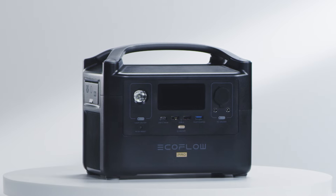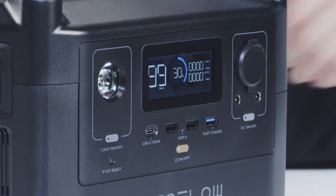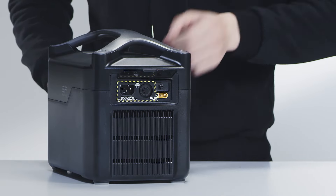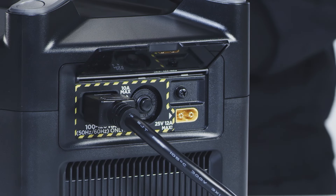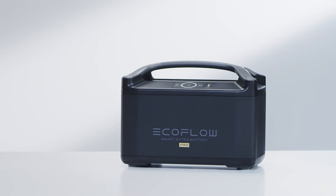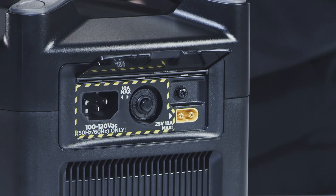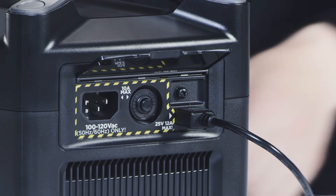The River Pro battery will be charged at around 30% straight out of the box. Fully charge the battery before you use the product for the first time. EcoFlow X-Stream technology enables you to fast charge your power station using a regular wall outlet or pure sine wave gas generator. River Pro could be charged from 0 to 80% in one hour, achieving a full charge in 1.6 hours. To charge the River Pro Extra Battery, please connect it with River Pro. River Pro can also be charged from the XT-60 port using solar panels or from a car using the car lighter socket.